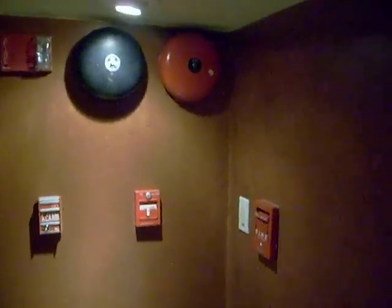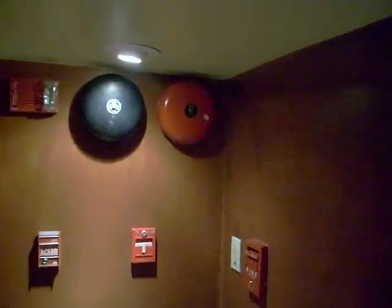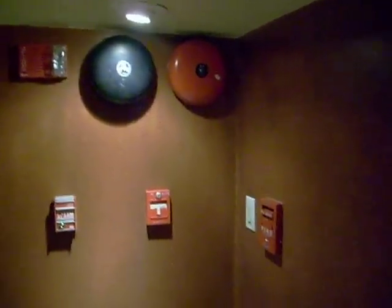I believe the original design for these older systems was you'd have some of these bells in series. So you'd have 6 4-volt bells equaling 24 volts AC. I believe that's how that worked because I've seen them at 7 volts as well.